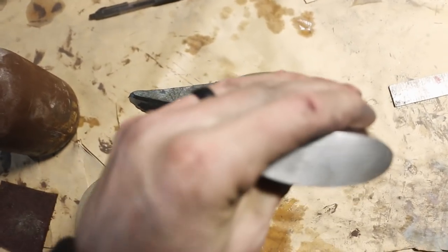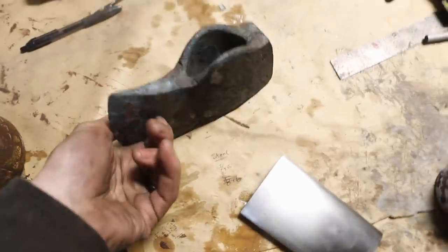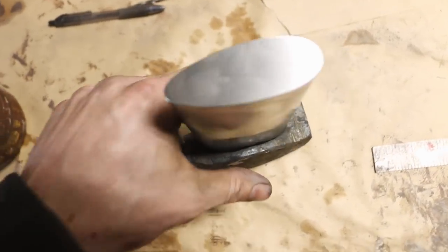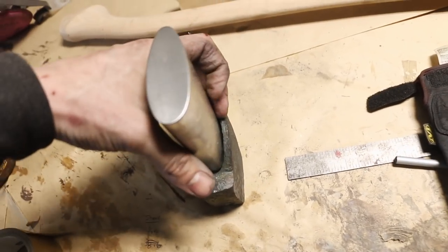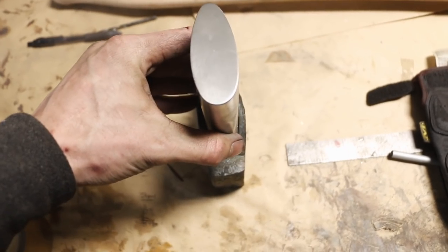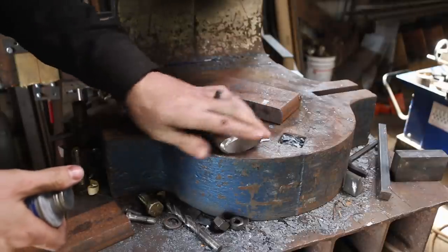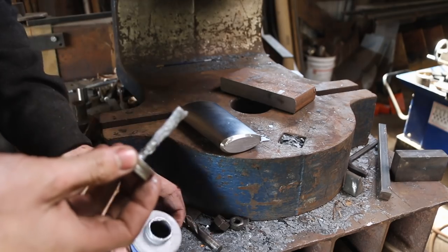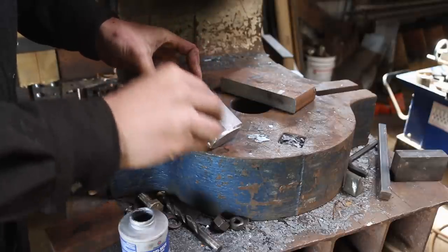Let's see how this is going to work out. That'll go in, yeah, just like that. I might have to do a little bit of tweaking on my other drifts, because there is a pocket of air on this side and this side — I'm hoping it'll stretch out when we push this in. I quickly put a bevel on this thing, and then I'm going to put some anti-seize on it. It just has a lubrication for when we stick that drift through the hot piece of steel, to make it a little bit easier.